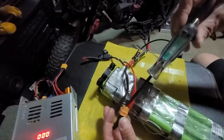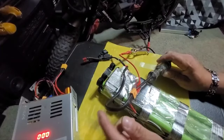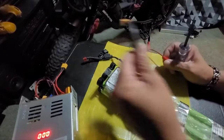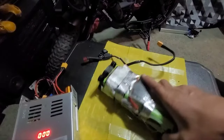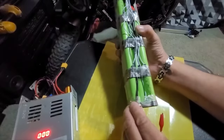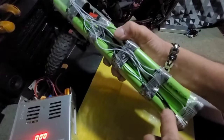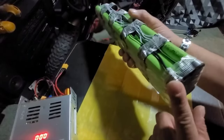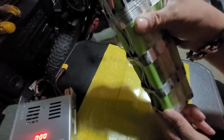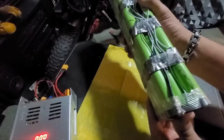There is no voltage coming through there. So I want to show you guys how to test these batteries and how to trace it down to see where the problem is. We're not getting any power at the connector. The first thing I would do in a situation like this is find the main ground on this battery. The main ground is right underneath this piece of tape right here — you can see there's a heavy gauge black wire going to it. The main positive or the main ground is going to be at one of the ends of the battery.